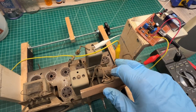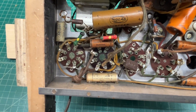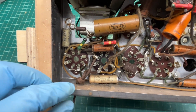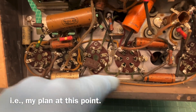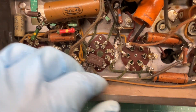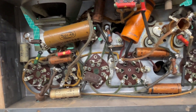Got some storms in the area. Let me switch back — you hear the difference? Just an old dried-up cap, I'm sure. I first thought I might have problems with the antenna coil; it's a little crusty-looking too, which is pretty cool. The chassis is large enough here underneath, and for this case instead of using a power resistor to drop the additional voltage that I need, I'll use a capacitor — it'll be nice and cool. Got plenty of room here to mount — probably an 8 microfarad AC capacitor rated at about 250 volts or so. I think I can squeeze one in right in this area, and I believe I have a couple. So when I get to that point I'll bring you guys back.